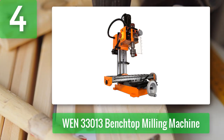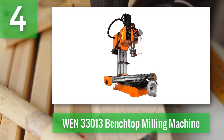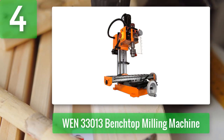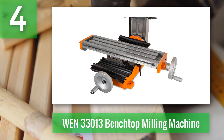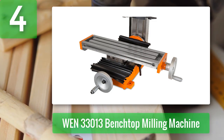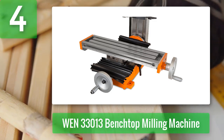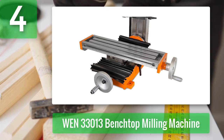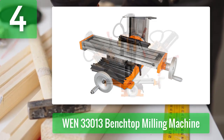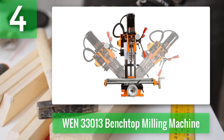33013 Benchtop Milling Machine. This 33013 features a 4.5 amp motor and a variable speed design with low and high setting. On the low setting, it delivers 100 to 1100 RPM, while the high setting delivers 100 to 2500 RPM. The table will travel 11.8 inches on the x-axis and 5.1 inches on the y-axis, with the head also pivoting up to 45 degrees to the left or right.